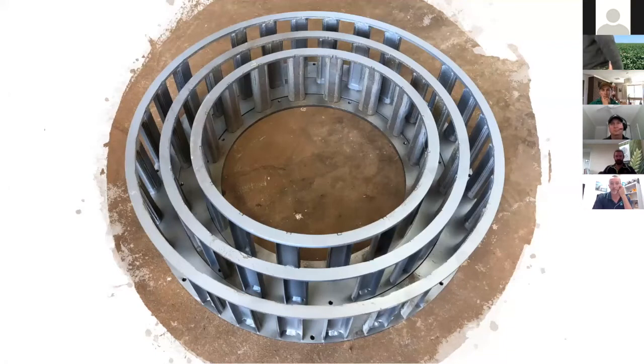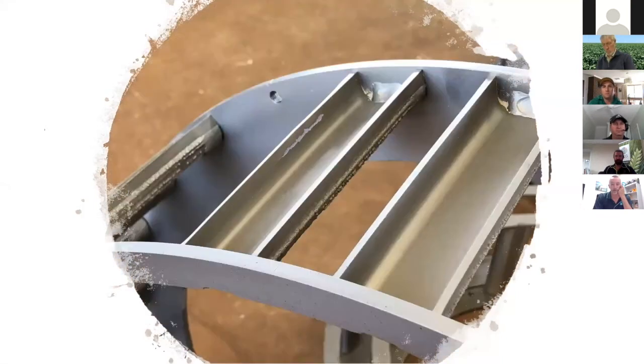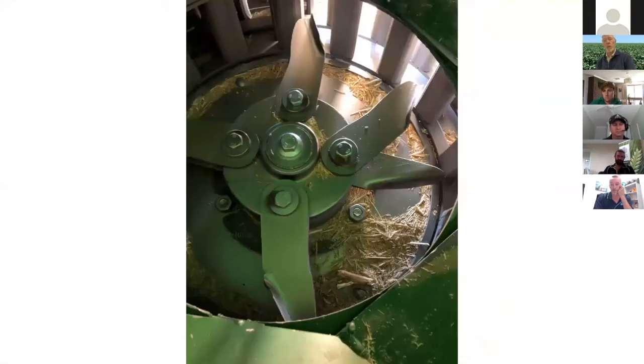So there's the inner workings of the Redicop mill. It's these sort of vertical bars, which are called the stators. So these 3 rows of stators remain stationary, and within that you have 2 rows of rotors and some flails on the inside. There's a closer view of the stators. You can see that one is just about worn through, and these are designed to be flipped over, so you can wear out both sides and double the life of them, with some tungsten coating there.